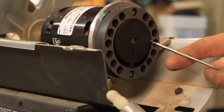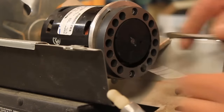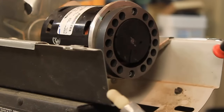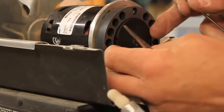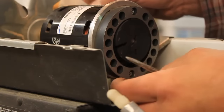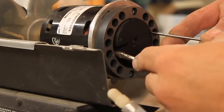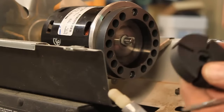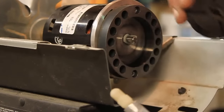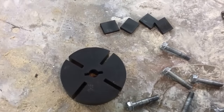I'm going to carefully try and get that out. I'm going to take a small screwdriver and take this little blade out. There's one — start pulling this out. This little blade came down; it's a little bit tricky to get out of here, I don't want to damage it. There we go — see, those should fall right out. We're going to clean this area out here and clean these little blades. There are four of them, then we're going to put graphite on them and everything should work fine.